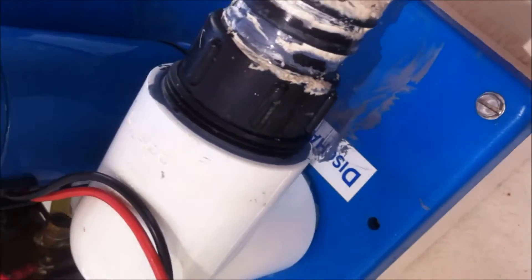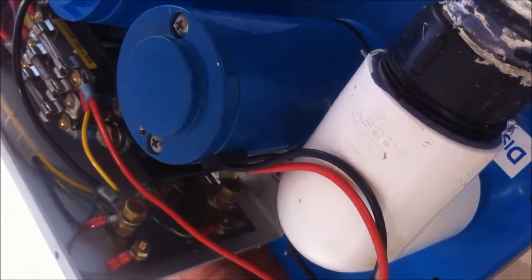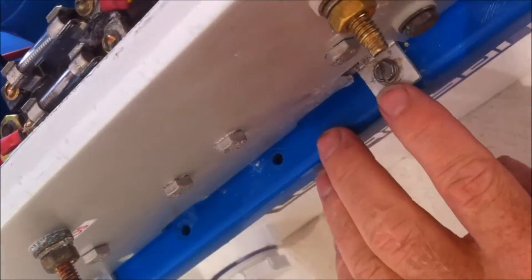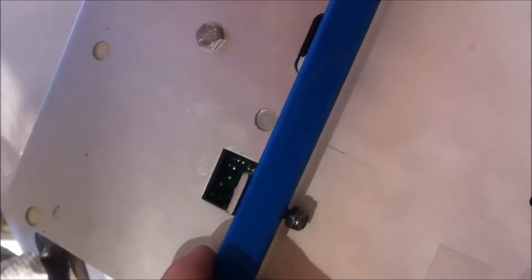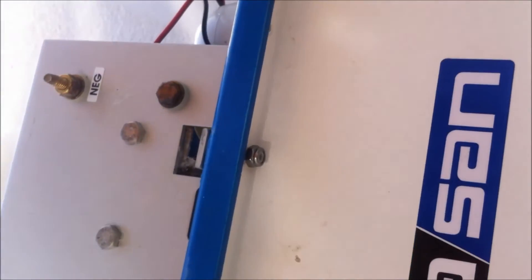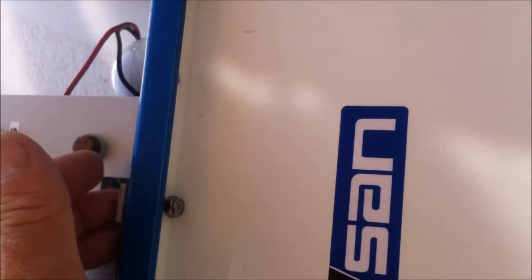About to reattach the top part — we've inserted four screws on the side and two in the back that we'll tighten up. There's a nut already placed on the bottom; these nuts will go all the way around. That seal is important because the smell from these LexSan units can be pretty bad, so you need to make sure you're sealing this up and making the bolts tight. I'm doing that by holding with needle-nose pliers and using a drill with a socket to pull each bolt in.